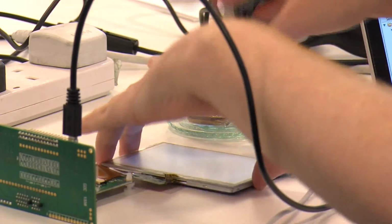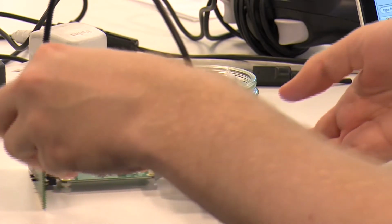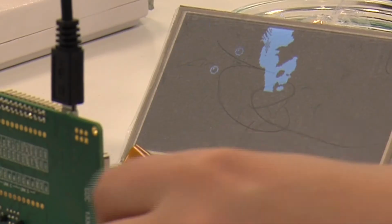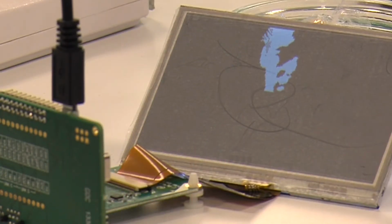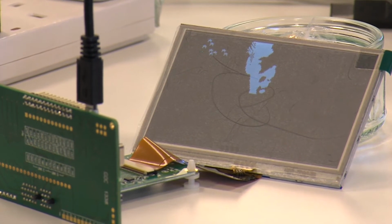There's obviously an LCD screen that I've attached to the slice kits, so that's the LCD slice. The XCore is driving that. There's a task which manages the frame buffers for drawing sprites on the screen. And then there's a task which emulates the CPU of this Chip-8. There's an instruction set, and it's sitting there emulating those instructions, and as a result, drawing on the screen.